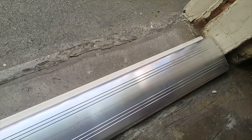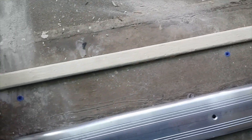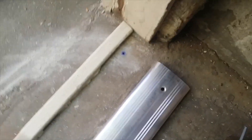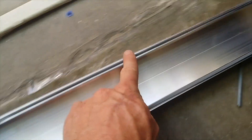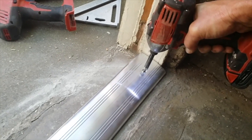You've got to make sure this is waterproofed — glue it down with some sort of silicone sealant and that'll work just fine. I've got my holes drilled and my plastic anchors in there. I took this piece of wood, actually a piece of the stop that I removed, and got that glued in place with construction adhesive because I cut off the end of the threshold that has the hole in it. I had to drill a new hole, and I have the rubber gasket installed on the bottom of this threshold.